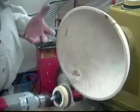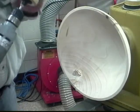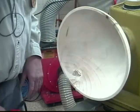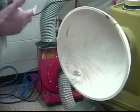I do not move away from the 80 grit paper until I can't see any tool marks. They aren't going to go away faster once you go to 100 and then 120. Stick with the 80. This one is your workhorse. It eliminates material faster than anything else.